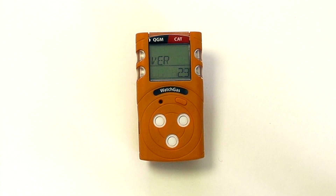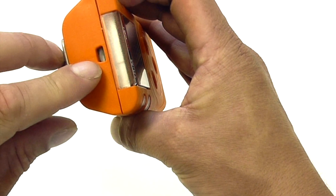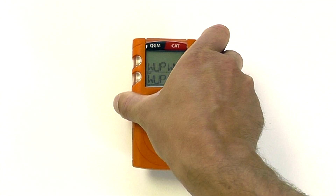As we can see, we have a full gas monitor here with LEL, O2, CO, and H2S. We have instantaneous warning and danger alarms, as well as STEL and TWA alarms. There is a full event history available within the unit, with data download via the integrated infrared port on the top.